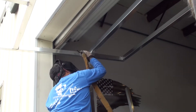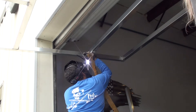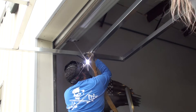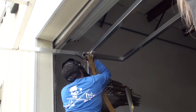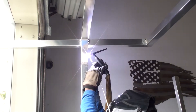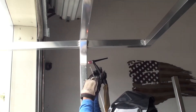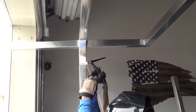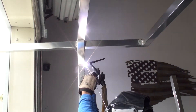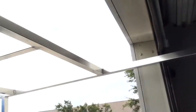Once the welding is done, we attached the seat of the rack to the boat with some long lag screws that went into the balsa core. There's a lot of 5200 sealant underneath each of those plates where the rack sits on the deck, and once that 5200 hardens up, that should be strong enough to keep the rack from sliding off the side of the boat.